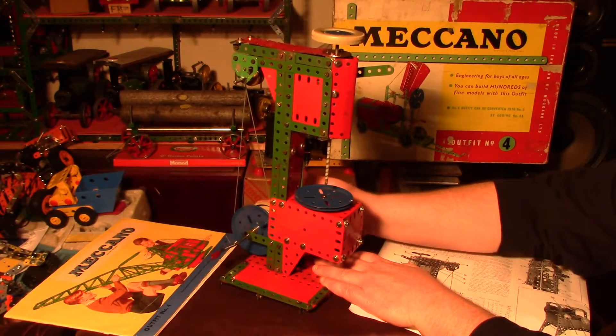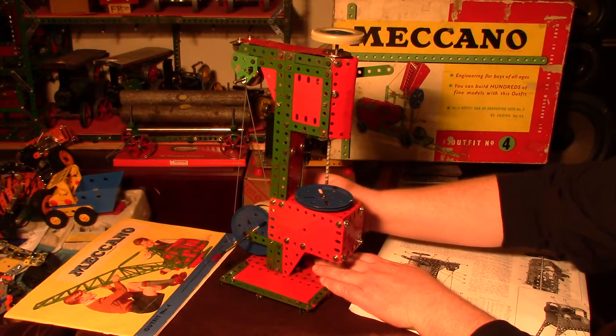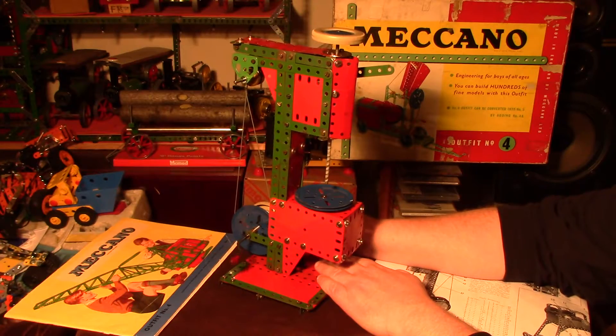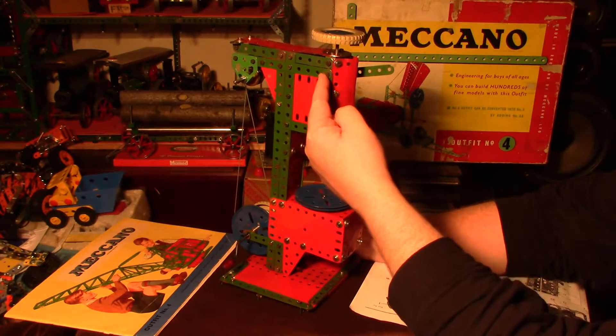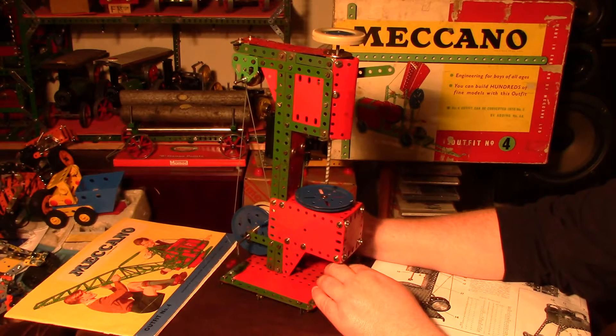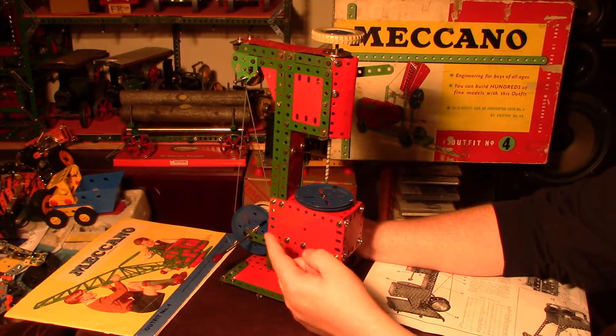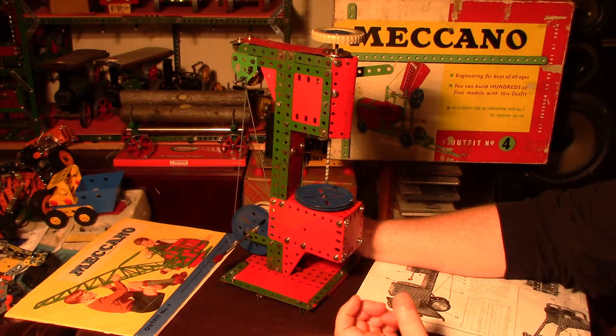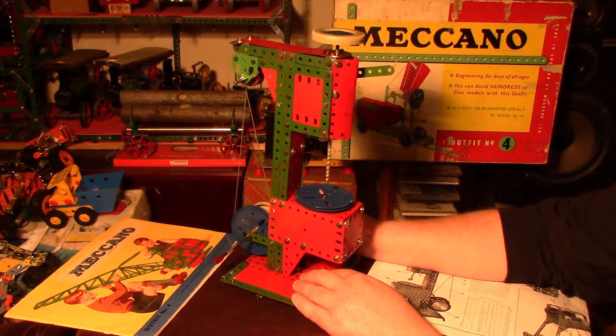The crank handle is turning, the belt is turning, and it moves up to two pulleys here. One is fixed, the other is free to rotate on the axle. The cord then continues horizontally to a pulley and runs around it and back down. Because of this belt routing, as the belt comes up one side the pulley goes one way, but as it goes back down to the large three-inch pulley it has to go the other way — so one of the pulleys has to be loose on the axle.